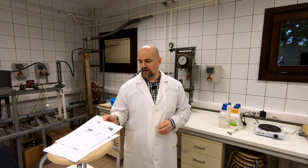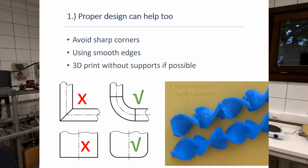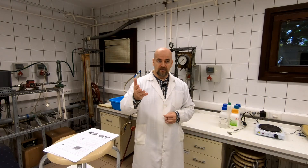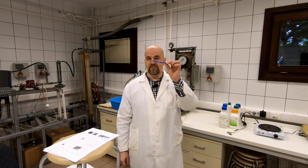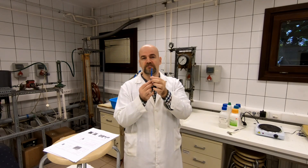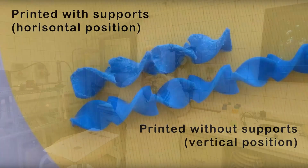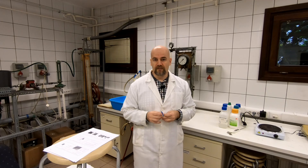Before we even start, a proper design can help too. Avoid sharp corners, use smooth edges, and try to 3D print without supports if possible. A quick example is my Helica Static Mixer. If I print it in vertical position without any supports, the surface is much better than in horizontal position where I had to use supports. When I remove them, there were very visible marks on the surface. All of this is for easier cleaning of the object.